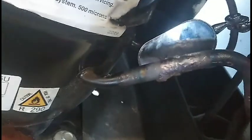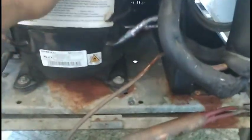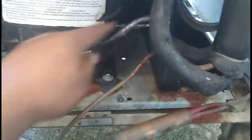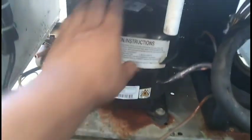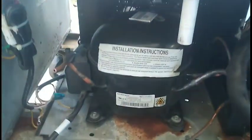That's the only little hiccup I found so far. This is the first time I've really done a full R290 swap — most of them were conversions where I'd just convert to another gas. I did an R600a unit once, but I changed it to 134a with a new compressor, so I didn't have that problem.